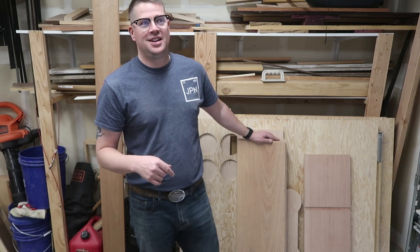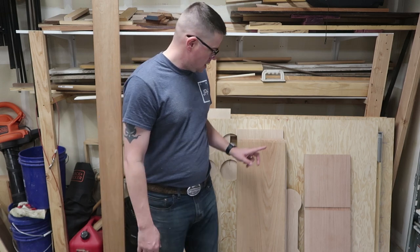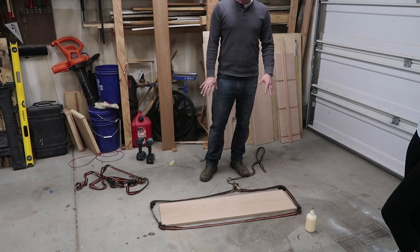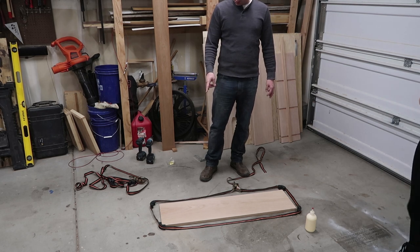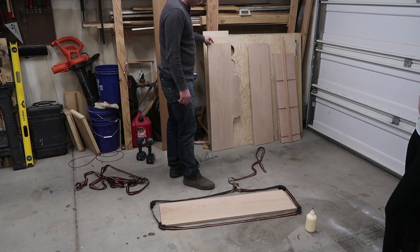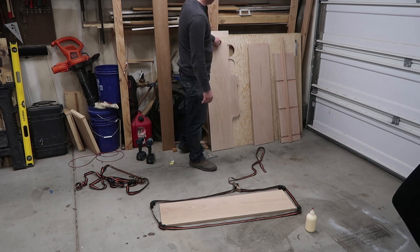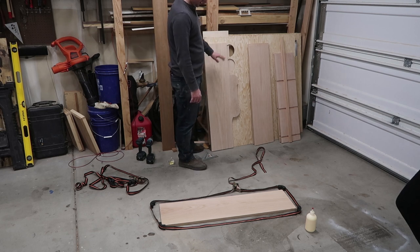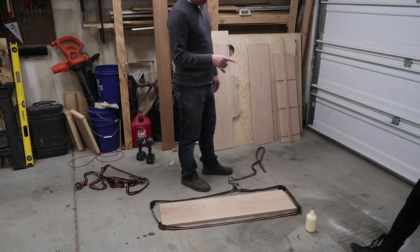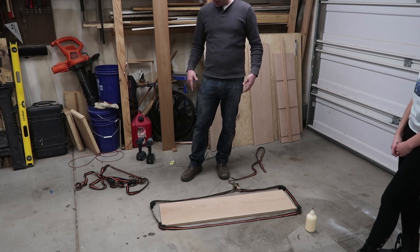I had a Toys for Tots event to go to, so only a few hours of work this day. Next day I'm going to work on assembly of the main body. I got the short board re-cut to the right length this time — positive. I trimmed the top piece down to 45 and a half inches, routed everything, and sanded everything down to 220 because some pieces will be hard to reach once assembled. My daughter Ava is going to help. After we get it all strapped and glued, I'll use small brass screws through the sides to hold the shelves in.